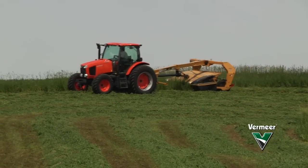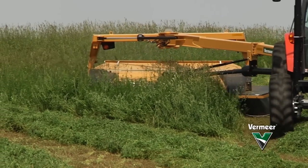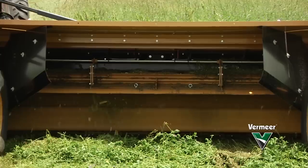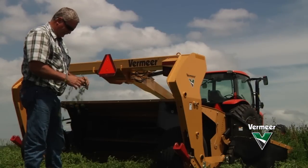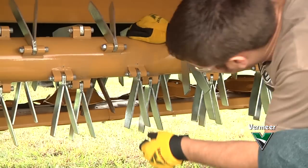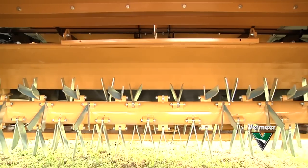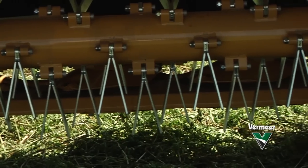All models are offered with either a steel roller or V-tine conditioner, to help decrease dry time and maximize quality by conditioning the material after it is cut. The steel roller conditioner features an aggressive profile that allows for consistent conditioning across the roller, and can be adjusted for gentler conditioning of leafy alfalfa crops. The tine conditioner features free swinging steel V-tines attached to one rotor, and an adjustable concave plate allows the operator to set the aggressiveness of the tine conditioning. This simple conditioning mechanism scrapes the surface of the crop to help decrease dry time.